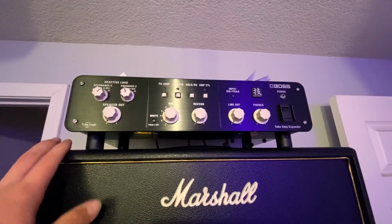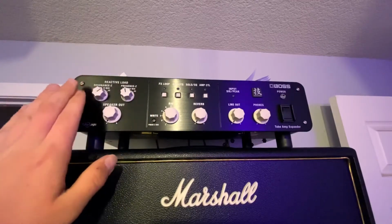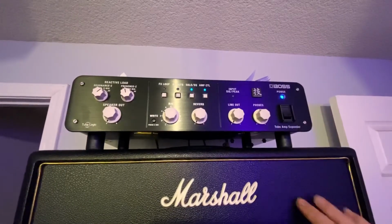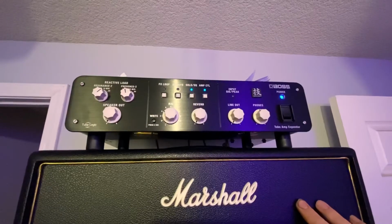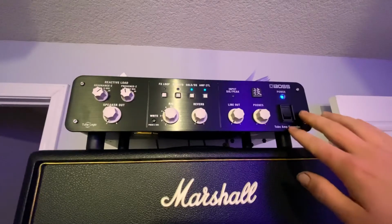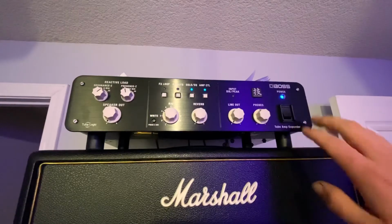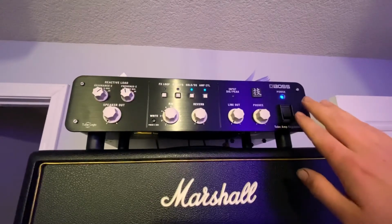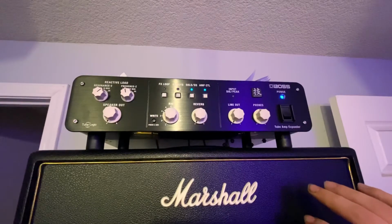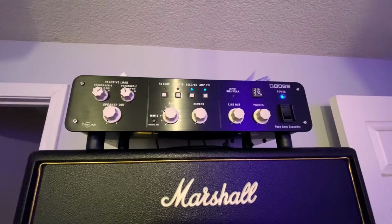But before all of that, I would say the most important safety tip is once you have everything dialed, have this unit powered on before you turn on your tube amp head. That might not be intuitive to some people, but if this is functioning as your speaker cabinet, it needs to be on before there is power going from this to this. So you need to have this powered on first, then turn on the amp. When you're ready to power down, power off the amp, then the unit. Let's flip it around to the back and see what's going on there.